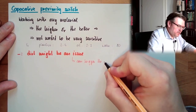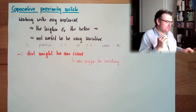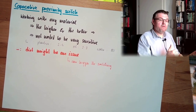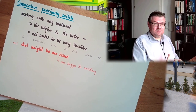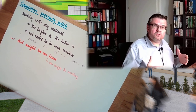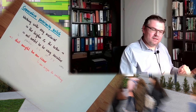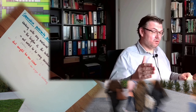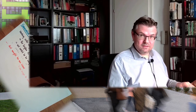Whenever we need to detect something which is not metal, we have to use capacitive proximity switches. However, we have to live with the downside that dirt and so on might influence it. For example, in a car we have to stop for stones, people, animals — and we have to detect them, so it should be capacitive. However, there is also crust and dirt, so the sensitivity needs to be adapted somehow. This is not that easy.